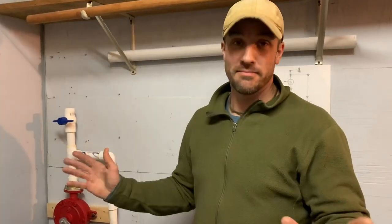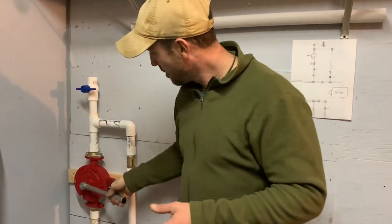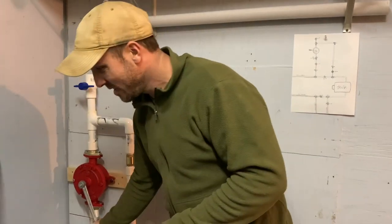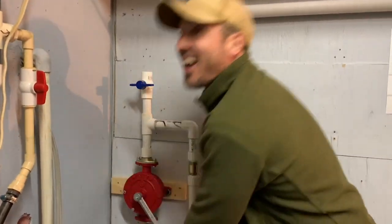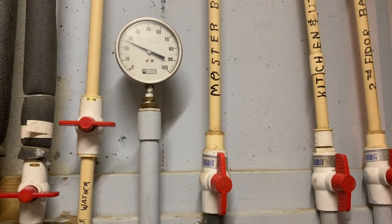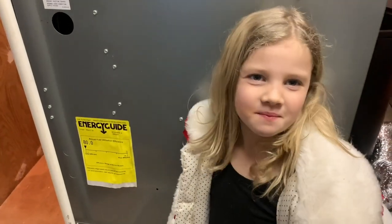The pump wasn't working initially, and I was bothered by it tremendously. I could not figure out what was going on. And then I thought to myself, maybe there's no water actually in the pump yet and I didn't prime it. So I opened this up and let it breathe a little bit, and it spurted out some air. And now listen — that's the sound of water flowing. Look at the pressure rising. With each pump, I'm getting a couple PSI. Look at that. Grid down, we don't care. That's awesome. We're moving some water now. Sage, this is going to be your job.